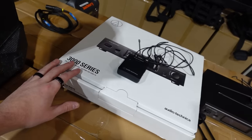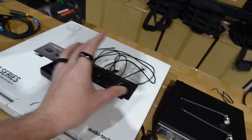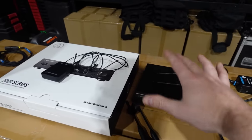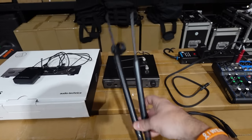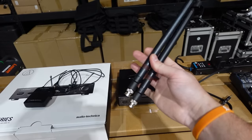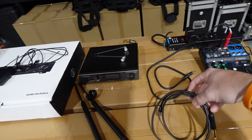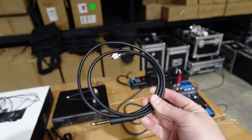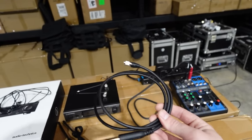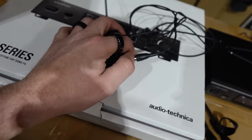We've got like 20 of these mics at this point, but all I did was buy one of the lapel units. Here's the main unit and the two little antennas that come with it. I did a couple of modifications — you need two additional things. First, I upgraded to half-wave antennas, which are optional. These stock ones are quarter-wave; the half-wave will give you better reception. These are actually Shure half-wave antennas. The other piece that makes it all work is a lapel adapter to quarter inch — this is what they use for wireless guitars at events — and this replaces the lapel.